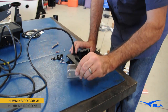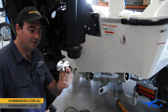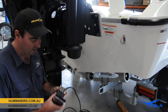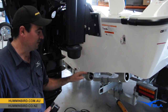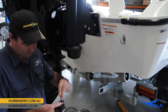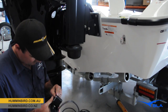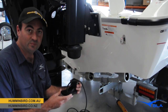The next step is securing our metal bracket to the boat. The next step is installing the metal part of the bracket to the transom of the boat. We're just going to loosely fit this temporarily so we can get our height set. There is an instruction guide with a template, but I like to do it a little differently. The first step is just to drop that bolt through there so I can line things up and get it positioned on the boat.